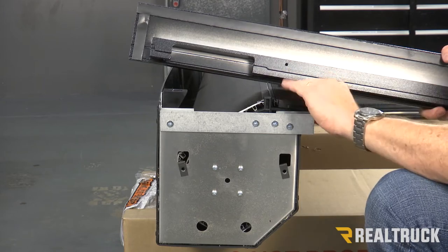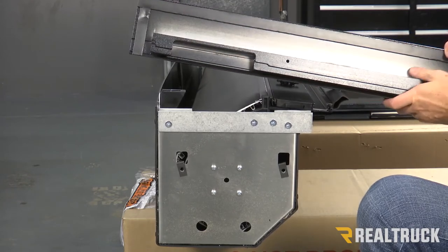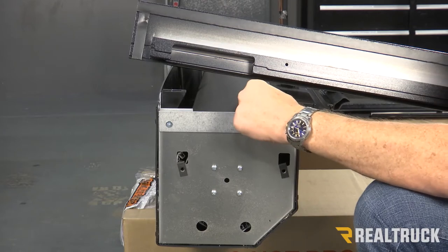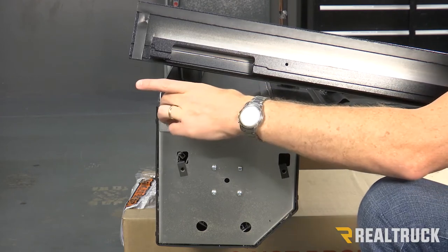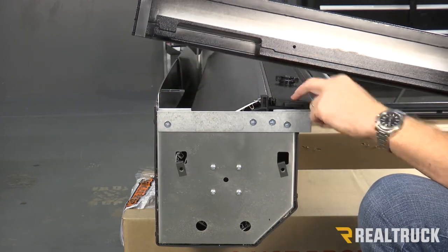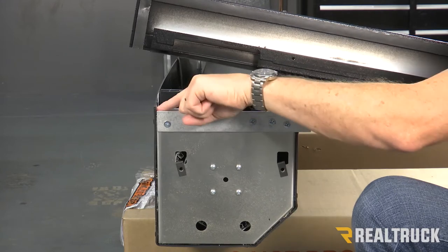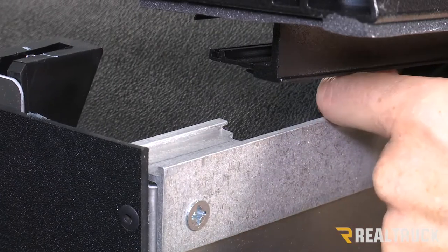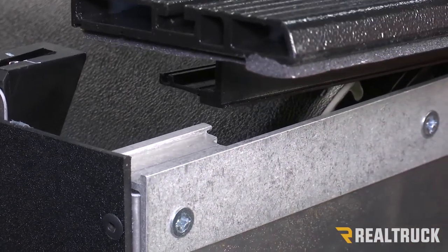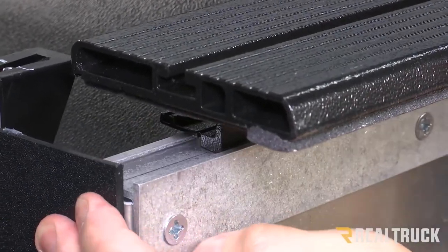When it does that, the blanket has to slide into the rail at the same time. The reason why we've got a cutout here is because this piece right here doesn't move, so that cutout has to go over top of this piece and then slide in. Once we get this threaded into here, this portion slides into here at the same time as this other portion slides in. Line up the blanket inside that channel area. This notch right here needs to be on the inside of this groove, so we need to make sure that's brought in. It goes inside the groove, and then we can line up the other side and slide everything into place.